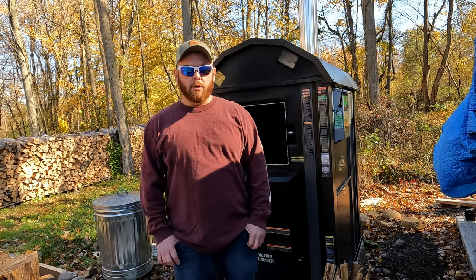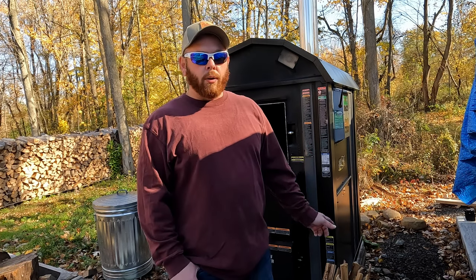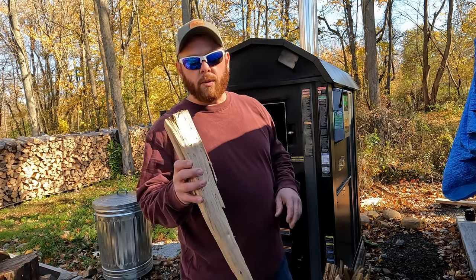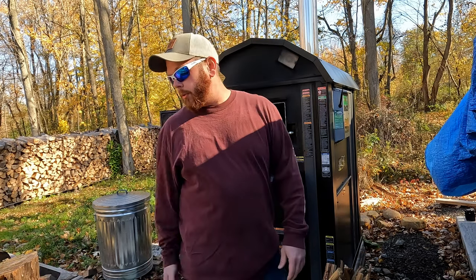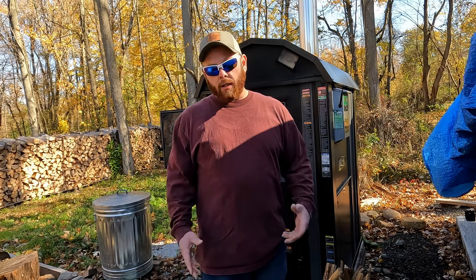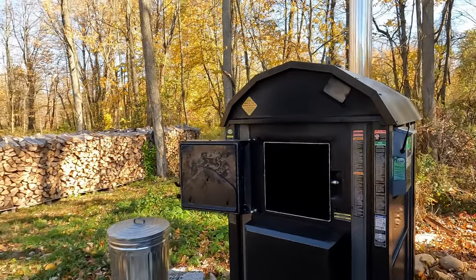I'm gonna get the fire lit. I may have to adjust the door seal once I get some smoke going. The first thing I've got to do — I've got the circulator pump already going, I'm gonna unplug that and turn the unit on. I've just got some goofy kindling pieces from splitting. I'll start a little tiny fire and once I've got that going, I'll throw in some pine lumber — really dry stuff I know is gonna burn well — and then I'll throw in some chunks to get a good coal bed going.